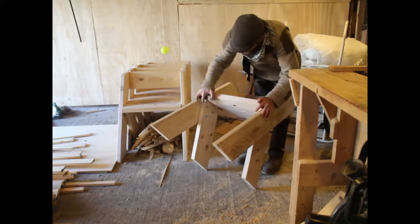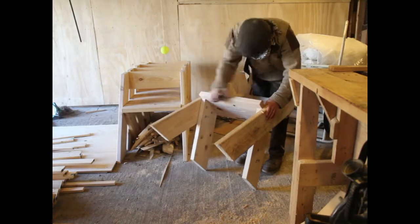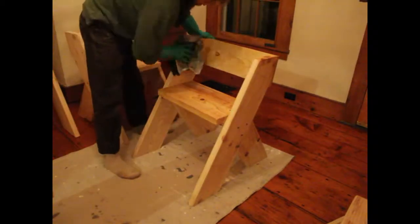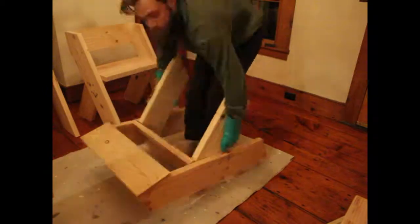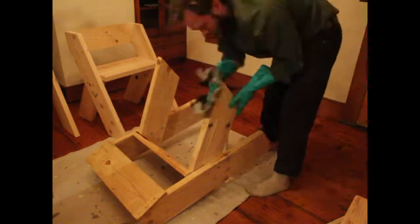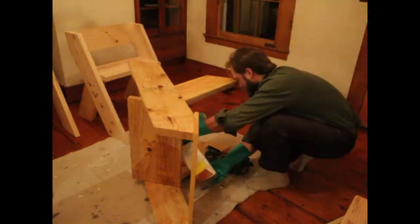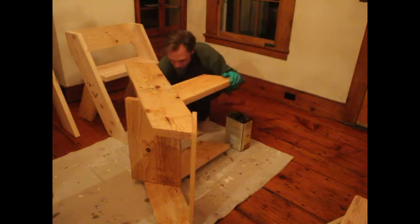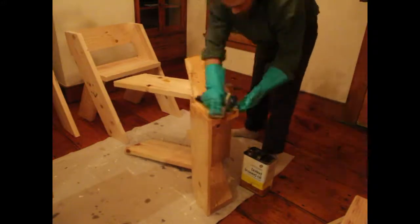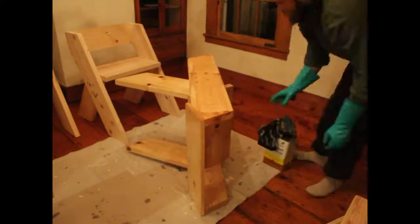You can use sandpaper — I'm using a microplane. Then I'm going to add a coat of linseed oil. You can make these out of cedar if you're going to use them outside, or even treated lumber, though I really avoid treated lumber if I possibly can. I'm adding a coat of boiled linseed oil, which is not edible — although linseed oil is — but it's not nearly as toxic as anything else we can use to coat these, like sealant or stain. You can certainly use those if you want a different color or a longer-lasting finish. These are going to be on our porch under cover so they won't get rained on, so I don't need much more preservation.